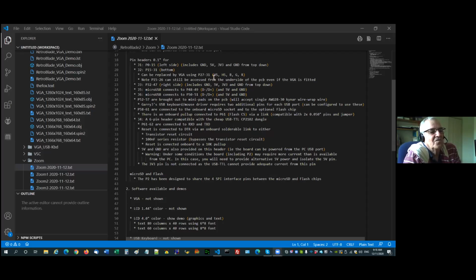The VGA sits on pins 27 to 31. A little unusual. I've modified Chip's VGA code, which takes 4 pins plus the 5th for vertical sync, and I've allowed it to be on a 4-port boundary rather than an 8-port boundary. I think there's about 3 lines I changed in the code. So that moves the vertical sync to the pin below the 4. So if you specify pin 28, which is what my code sits on, you've got 28, 29, 30, 31 for the horizontal sync, blue, green, red. And then vertical sync is sitting on pin 27. I wanted to shove it out of the way so that if I really wanted to do something, I had the maximum number of contiguous pins before the VGA got in the way. Hence, you can go 0 to 26 around it.